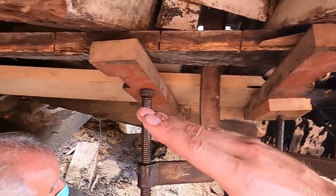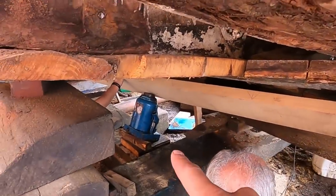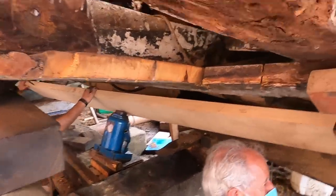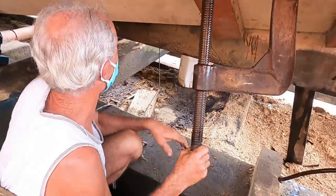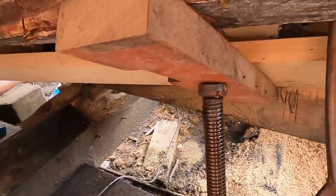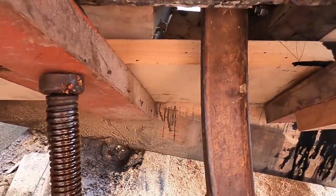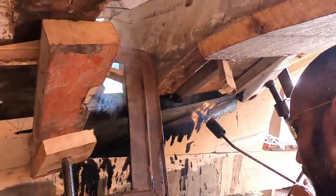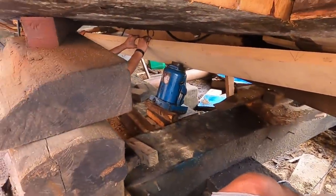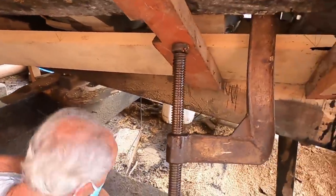The rest can start bending more and more, and there's even a jack over there that's going to help jack that plank a bit closer to the keel. And here this is also being tightened bit by bit with the help of these planks pushing that in. So the more that gets heated up, the more that can tighten, and the more the jack can push the plank against the boat.